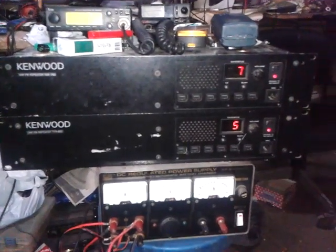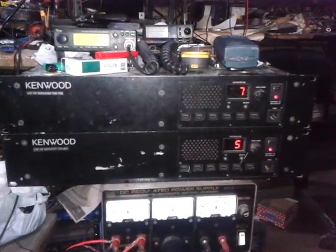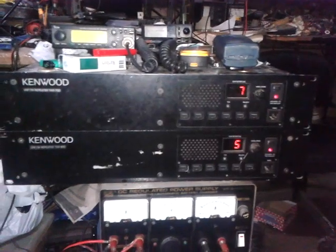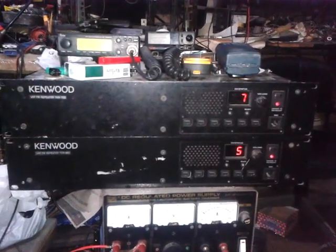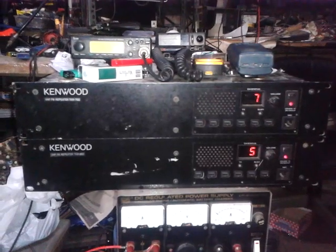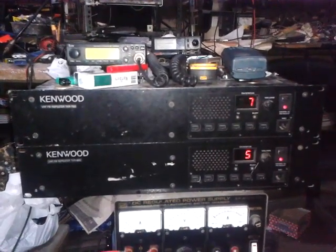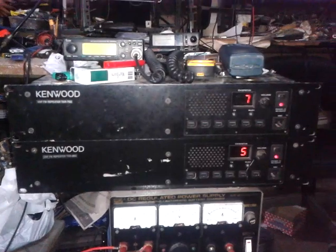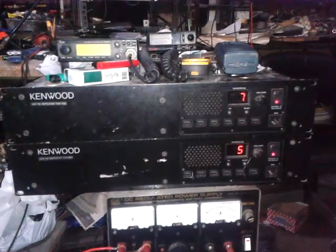As you can see, each repeater has its own station ID. I programmed it with two different messages on the station ID. This station ID can be programmed with a timer — either up to 15 minutes, a second, or an hour, depending on your program. Right now I have programmed the repeater to transmit the station ID every 30 minutes for both messages.